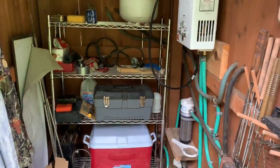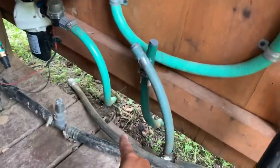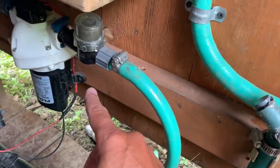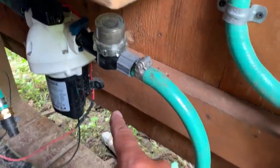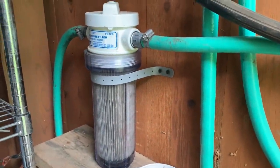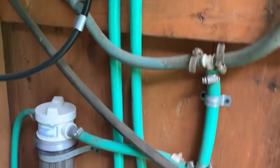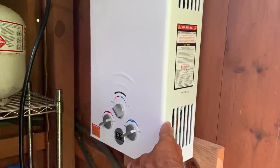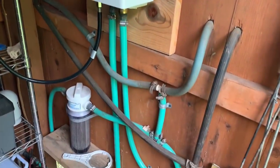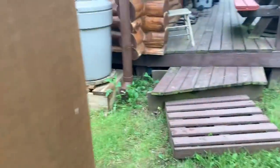Let's take a peek at the pump house. It's also become kind of the tool shed. I have the garden hoses coming from the rain barrels, taking the water into this flow jet pump. The flow jet pump is actually pulling the water out of the rain barrels, running it into a household micron filter. I don't use a real purifying filter — basically just to get it clean enough for dishes and showering. From there, I have it plumbed with hot and cold water into this instant hot water heater, which runs off a gas grill propane cylinder.